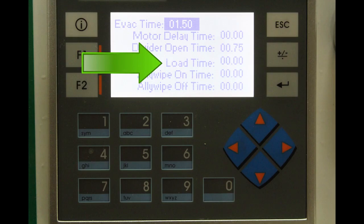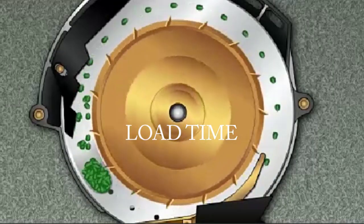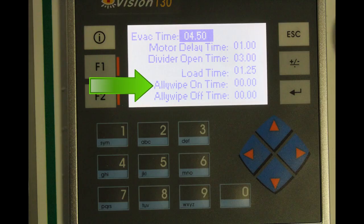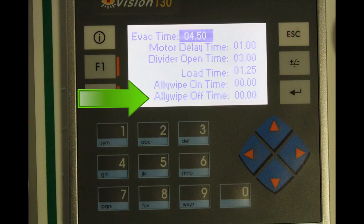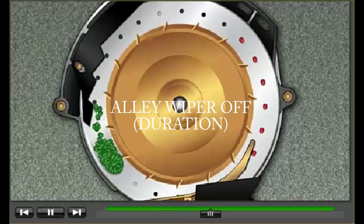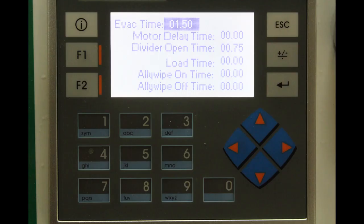The fourth setting is the load time — the time to load the plate with new seed, picked up by the rotating seed plate. This primes the seed meter with the new plot; when the planter moves forward it will begin planting using the mechanical transmission, enabling you to shorten your alley. The fifth setting is the alley wiper on: the time after evac begins before the alley wiper turns on, leaving a crisp edge at the beginning of the alley. The sixth setting is the alley wiper off: the duration from when the alley wiper turns on till it turns off, leaving a crisp edge at the beginning of the plot. Set this to 00.00 seconds to disengage the alley wiper — it will not activate if set to 00.00 seconds.